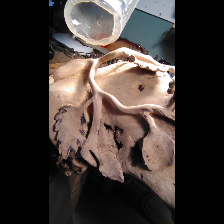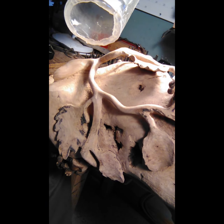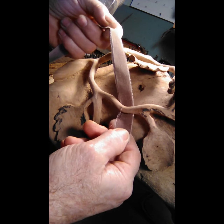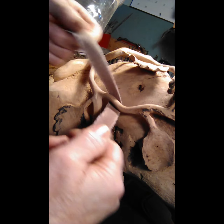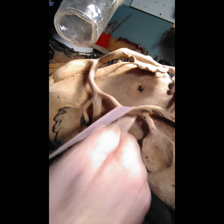I've got this all undercut and rounded pretty good. To make it round, you sand it off — take your emery paper. Hard to find nowadays but you can probably get it online. You just run the sandpaper back behind and run it in different directions. Don't stop in one spot or you'll make a channel. Go off at different angles, keep it moving.